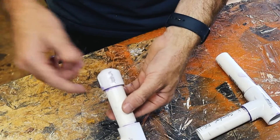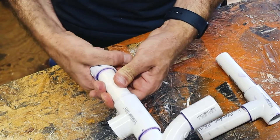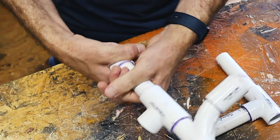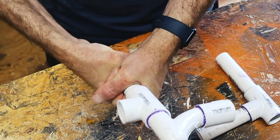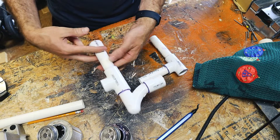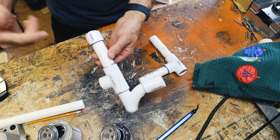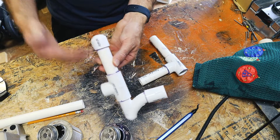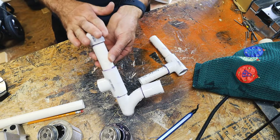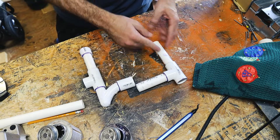I can't believe none of you stopped me — why did I glue this cap on? How am I supposed to clean this out? The cap is glued on. Whatever — if I ever have to clean it out I'll come back, cut it, and add a new cap. For now it's a glued-on cap. Do not glue the cap on; you have to be able to remove it. Water isn't coming up this direction, so you don't need glue up here. This other T doesn't have a cap at all — it's your vent.